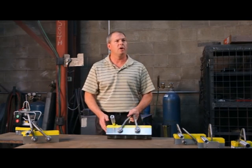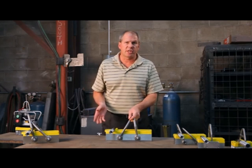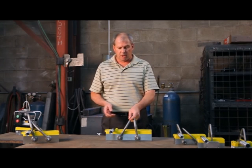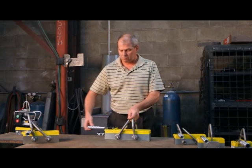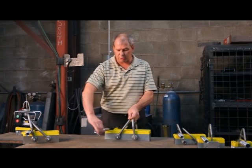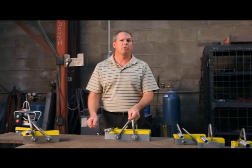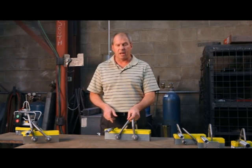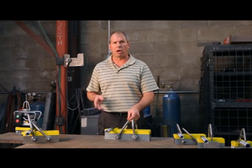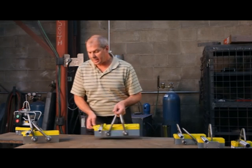This is our 4x7, 4,400 pound lifter rated at about 1,400 pounds per lift. It's just that easy to actuate. How many passive shunting lifters are that easy to turn on with a 4,400 pound lifter? That's MagSwitch technology enabling that — it allows us to make larger lifters, lighter, handling bigger loads and easier to actuate.